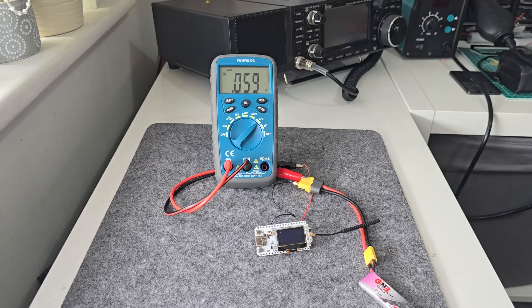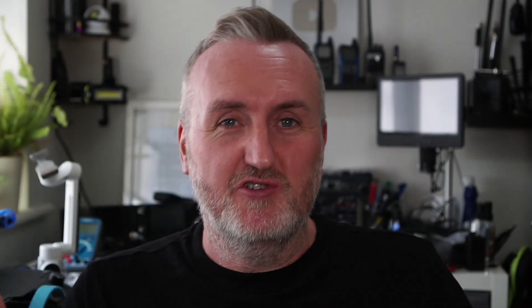It looks like the integrated Bluetooth on these ESP32s is quite bad on current. We can get it right down to 59 milliamps — still nowhere near the T114, but it's made quite a bit of difference. The T114 is very very power efficient. I'm not sure how it compares to RAK — I need to measure those, but from results I've seen online RAK might be slightly lower. Anyway, this would run on quite a small solar panel, and there is a solar panel input on the back of this device, so I'll be testing that soon.